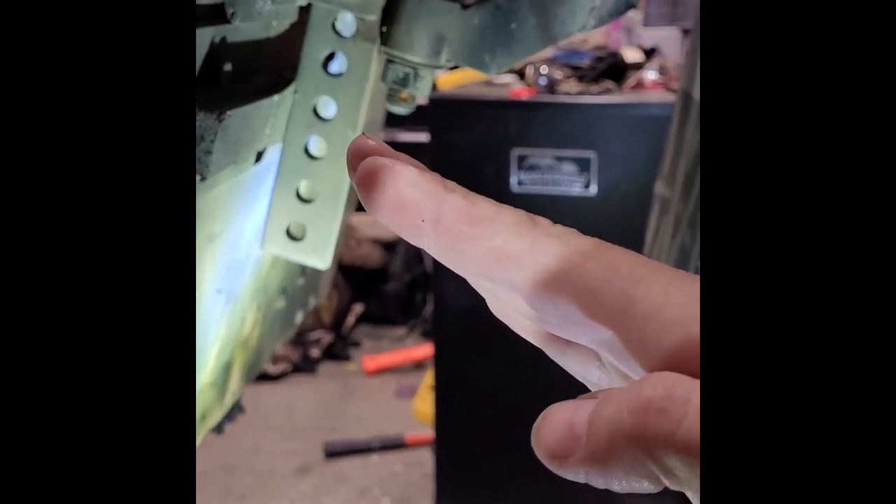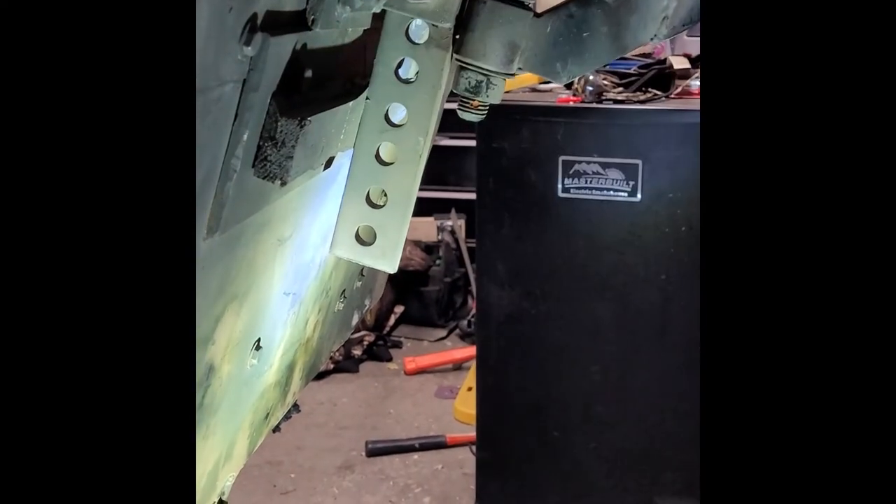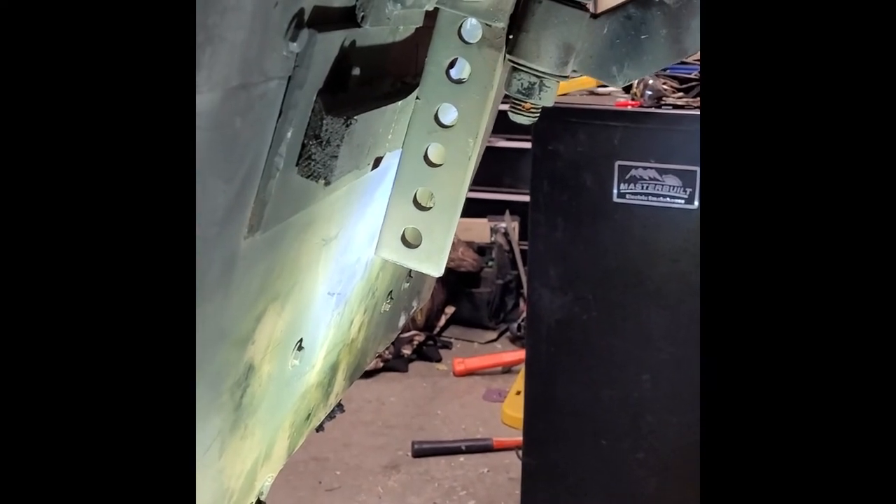Without that piece of steel above, that support would have gone straight through my duck boat. If you take the piece of wood out, it changes the whole pitch of the motor, swings it into the boat, and tips it so you can't propel yourself forward — it will try to propel the boat up and out of the water and you'll be dead in the water. This happened to me two or three times this year out there, and luckily Pierre was with me to physically pick the motor up, put it back down, and reclamp it as parallel to the ground as we could. I'm hoping all these fixes — the supports, the welding, the grinding, the cutting, and rubber dampening — will work, and I'm very confident they will.